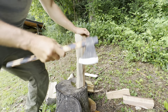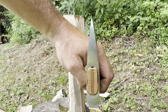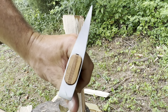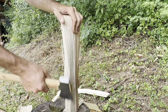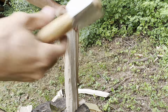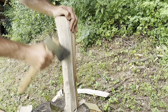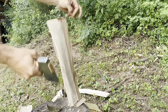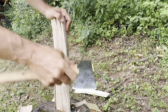The same can be said for this little Marbles axe head right here. This one is actually a really good kindling splitter — in conjunction with a wooden mallet baton you can make short work of some kindling with it because of its wide shape. It's also quite good for carving chores because you can choke up on it. I made this handle in a previous video specifically so I could choke up on the axe head and get really delicate, fine, accurate little chops.